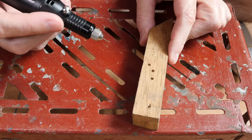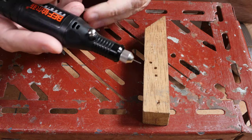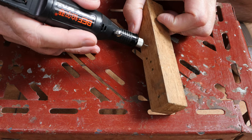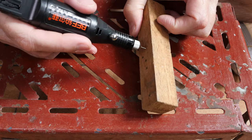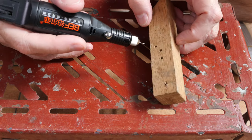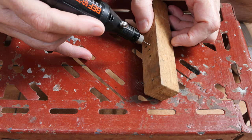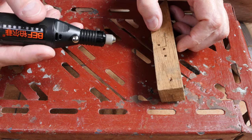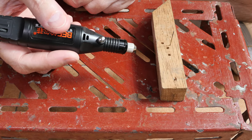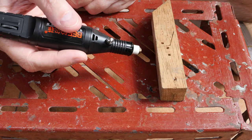I've got a piece of wood — kind of a medium wood, not hardwood, not a soft wood like balsa. I've got my fine drill bit in there again. It slows down a bit at full power. Would the Dremel do it faster? Maybe a touch faster. That's another problem — I found that the collet comes loose. As much as I crank it down — well that was an unplanned demo, but yeah, that's one of the things: the collet comes loose with the finer tools.